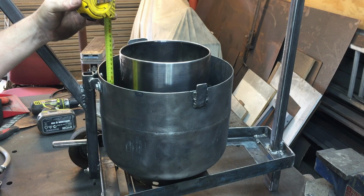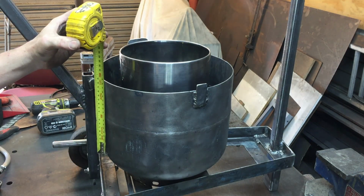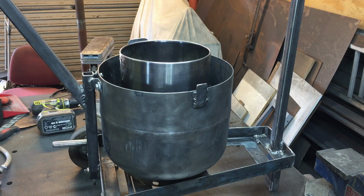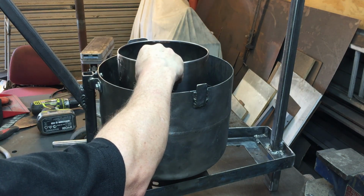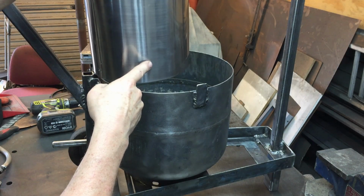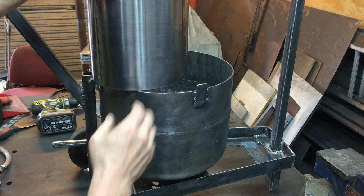So that's just above 190, it's about 193 millimeters. So if I go down to 190, that'll give me 3 millimeters above the floor. Now I've just got to line up how that works with this inside piece of steel here, so that the hole goes into this and, you know, on an angle in the side here. And we're not too far on the outside, so we need to be in here with still the steel on the outside there.